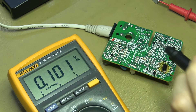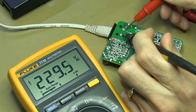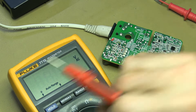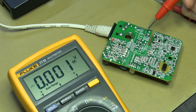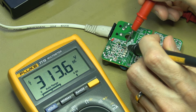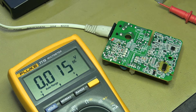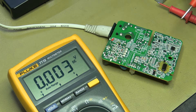There's definitely power here. Measuring that — yeah, 230 volts coming in right there. Let's measure on the DC side. The AC flows in here, here are the two diodes with the bridge rectifier and the other two diodes. So there's likely DC around about here — there we go, that's 313 volts DC. There's definitely energy all the way up to here.